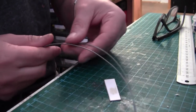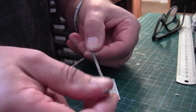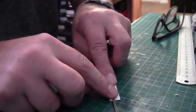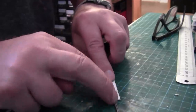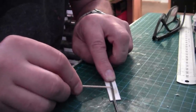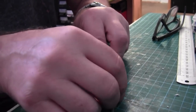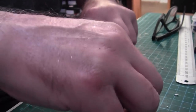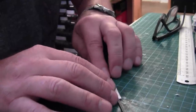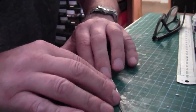What I'm doing at the moment is gluing two single cores together to make a twin core, so that it looks a lot tidier when it goes across the apex to reach the other side of the steelwork. It's just a case of a little tiny drop of super glue and then just run it along the joint. That way it doesn't become untidy - it'll just sit in the recess of the A-frame and it'll look a neat job, so even if you do manage to see it the cables are not just hanging.